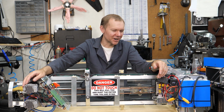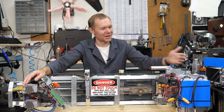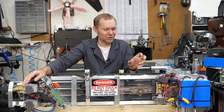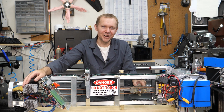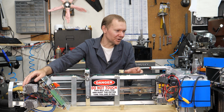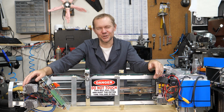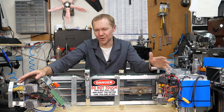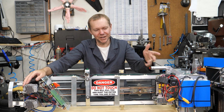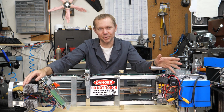And then as we were trying to get consistent, it really came down to the magazine, getting knives to come out of the magazine consistently. Every time we turned it on, I would just eyeball the carriage and the clocking of the fingers and try to make them vertical and put it in roughly the same spot. And that just wasn't consistent enough. So I said, okay, we've got to take a couple of days and get a home switch set up on there properly.